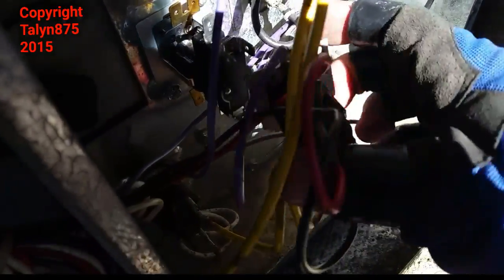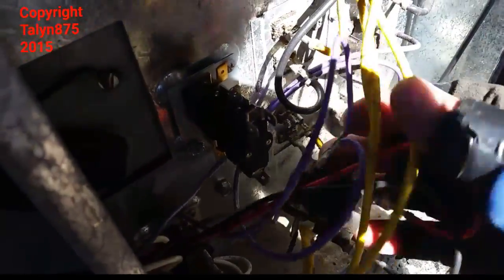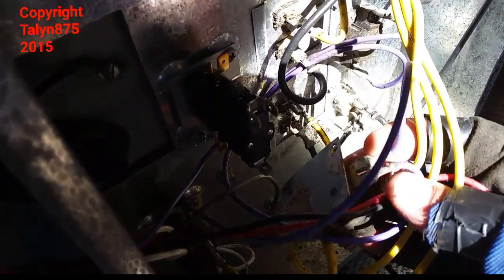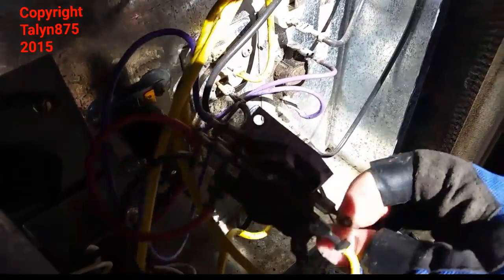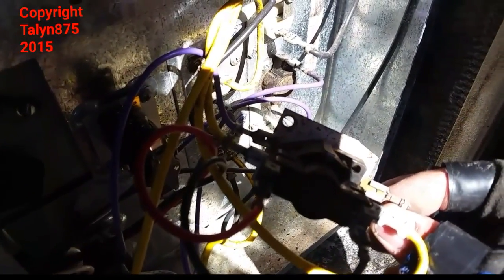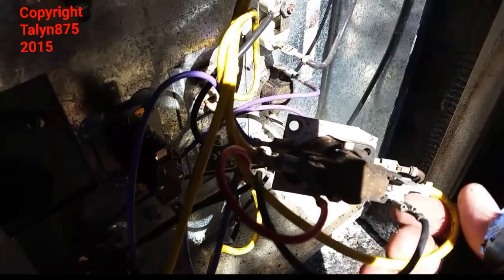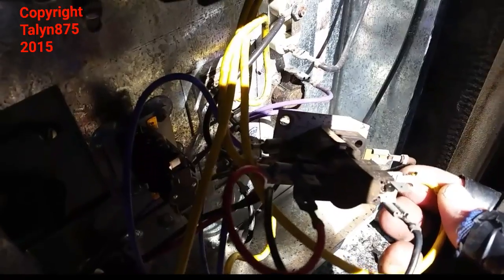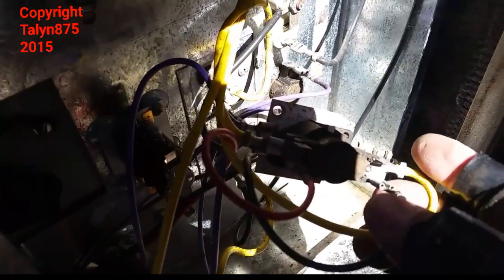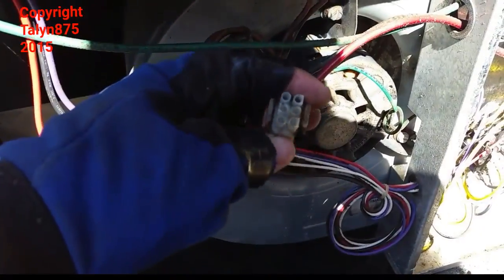We have the two sequencers here — the new one in the back and the old one — and I'm going to swap them out wire for wire. We have two purples on the bottom which are the common for the coil, a brown wire which is our 24-volt hot or heat signal, 240 volts coming in and out — 120 volts a piece — and the wires for the blower are on top. Those were wired incorrectly and we're going to straighten that out as well.